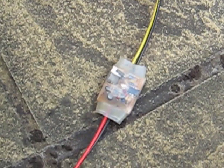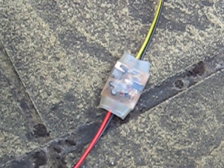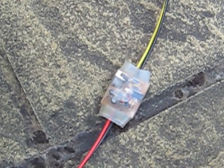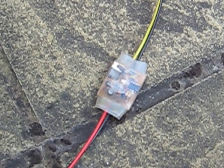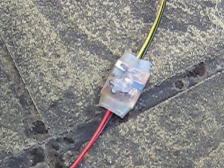The purpose of that is to monitor the voltage of the battery. And when it gets to a safe level, a maximum level, the charge controller starts to pulse width modulate. And that means it switches on and off rapidly and holds the current constant, holds the voltage on the battery constant.